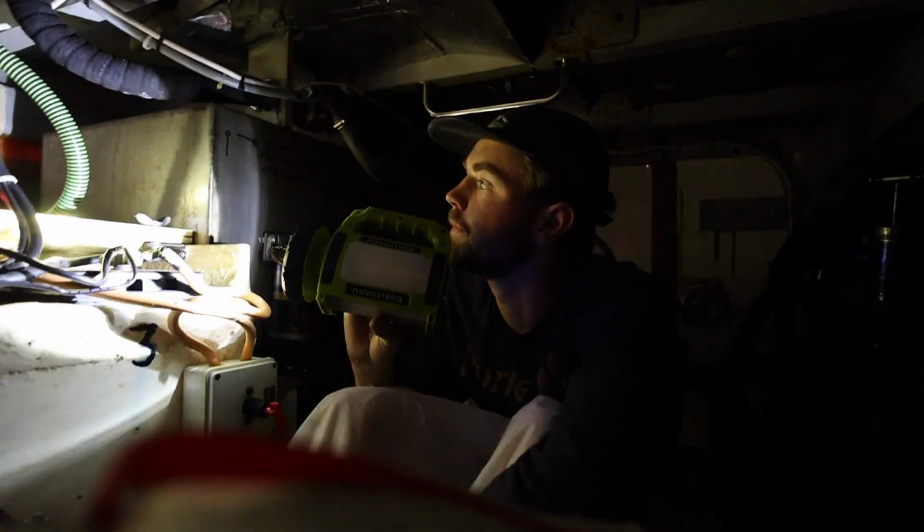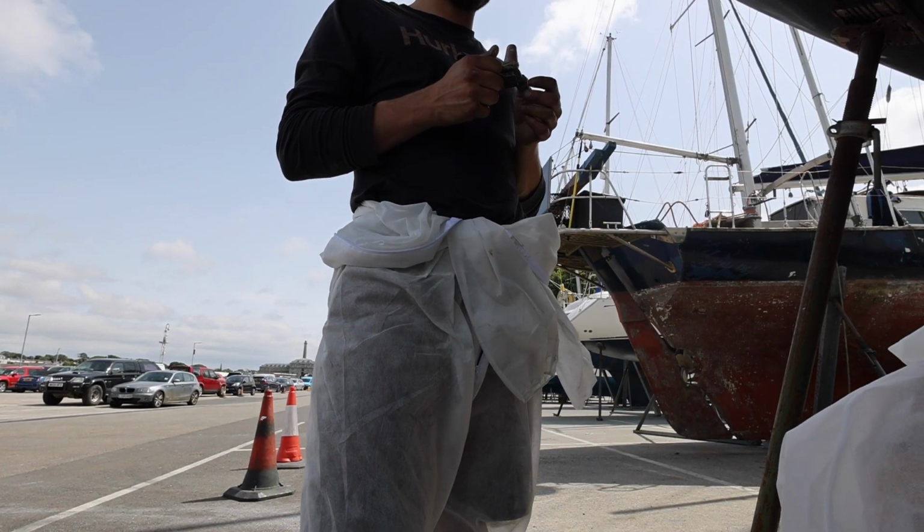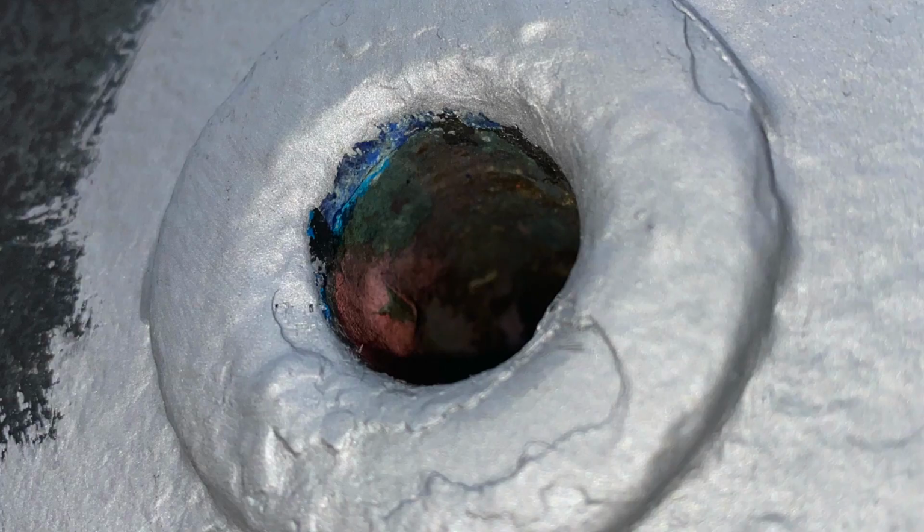When we started taking out the suspicious Seacocks, aka the 5 which weren't Blake's, to clean and service them, we started seeing specks of pink on a few of them. This meant that it was time to investigate the skin fittings more thoroughly, and unfortunately we found 5 were all pink and therefore needed replacing.